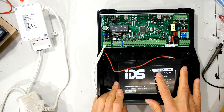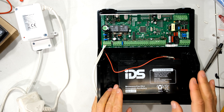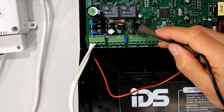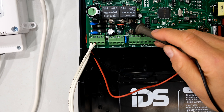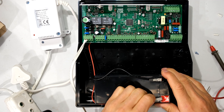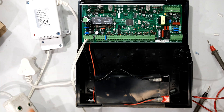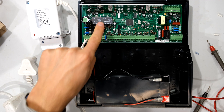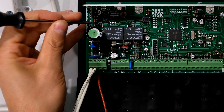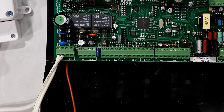You can use a bigger battery — an 8 amp-hour or even a 12 amp-hour UPS-type battery works very well. If your battery isn't charging, check this fuse: it's a 4-amp fast-blow fuse. When mains power is off, the panel operates from the battery; if the battery gets disconnected the whole system goes down. If you want to start up the alarm from battery only without mains power, there is a kick-start feature — short out these two terminals and the panel will start up from the battery alone.